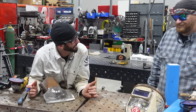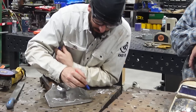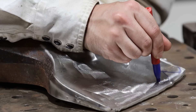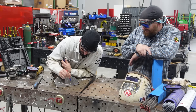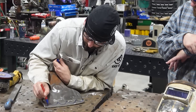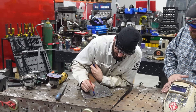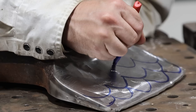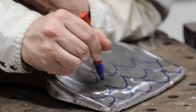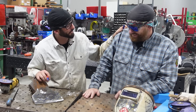Where all the sparks are flying I'm still hitting the carbon, so we're still on top of our parent material. But as soon as I get up on the edge here, our sparks start to leave because our hard facing rods have little to no carbon in them. Nice and clean. Now we decided this old dog looked like a mermaid tail, so we're going to put some scales on it. You've got the hardened edge on one side but we want to put some abrasion resistance on this too — so let's put some happy little scales. We don't want to get too tight with the radiuses as we do have to stick weld these, and if we make too small scales they won't look like scales at all — they'll just look like big old boogers.